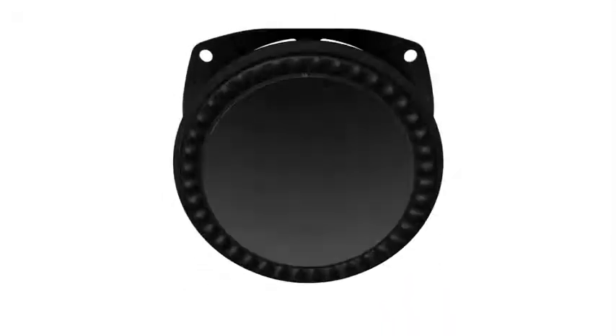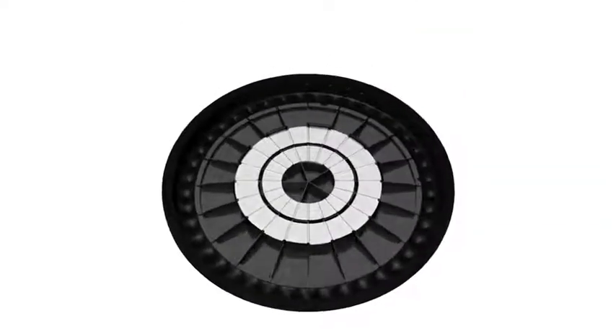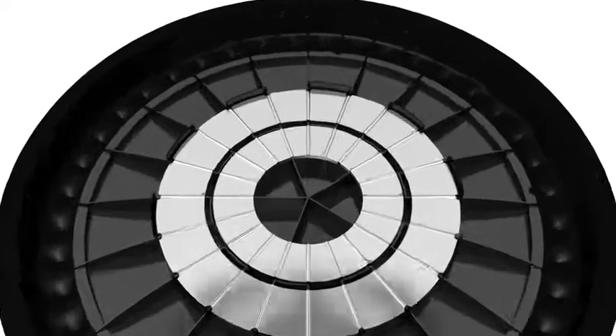How did you do it? We started by designing a flat radiating diaphragm. This needed to have stiffening ribs on the rear, which were integrally moulded. We also mounted aluminium discs onto the back of the ribs to create a slim but very stiff structure.